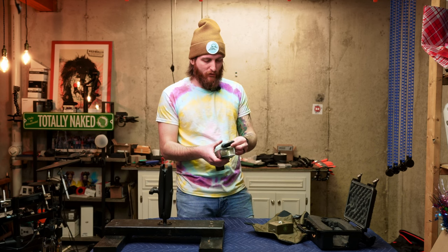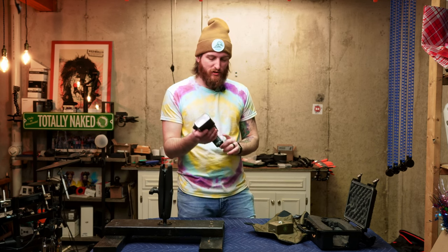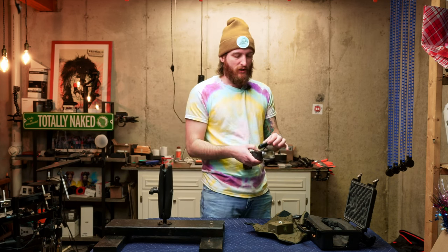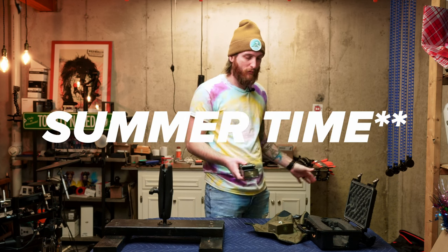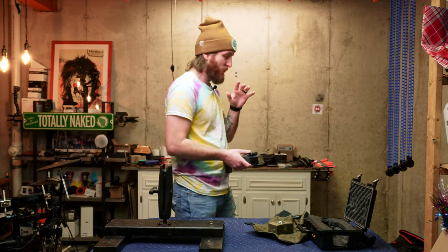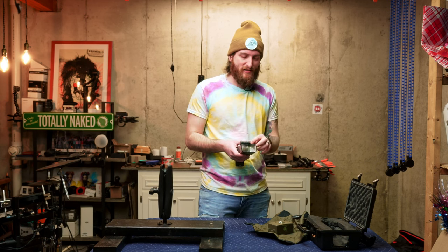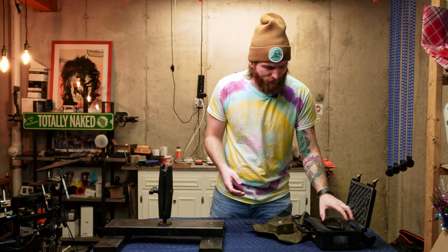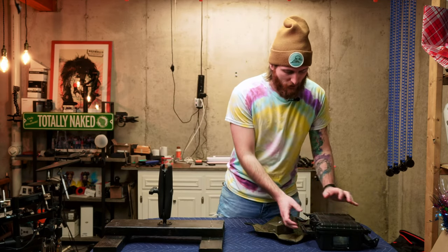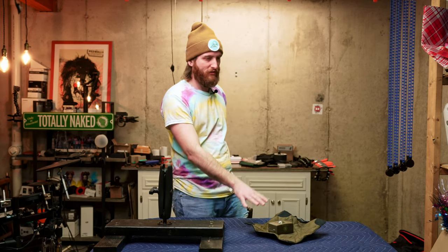The only other thing I did with this build is I opted for battery packs to extend battery life, because originally these triggers and receivers run off triple-As — they're not going to last too long in the wild. So I went with double-As, and this whole setup in the wintertime can definitely last me at least a month running off of double-A rechargeable batteries. Those fox photos — that series — was in the dead of winter here in Wisconsin and temperatures are very cold, so I was getting about a week because the batteries don't like the cold weather.